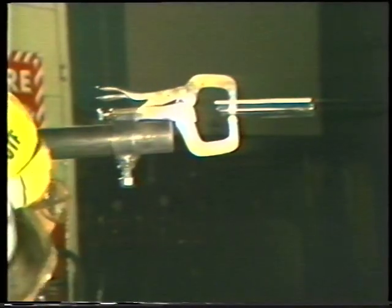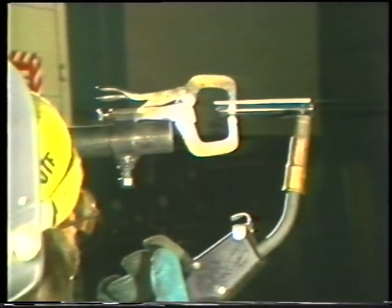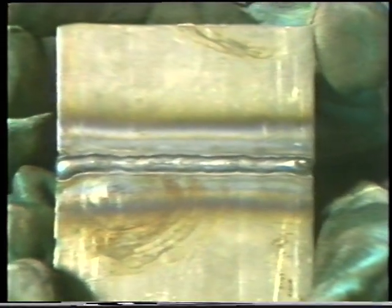Hold the torch in the center of the root directly under the weld joint at 90 degrees with no side angle or lead angles. Strike the arc and move across the joint, making sure the wire is on the leading edge of the puddle as you move. Move at a steady speed, making sure you are penetrating through the back without allowing the puddle to drop off. Continue across the joint until it is completed. Inspect the joint for uniform bead and proper penetration.